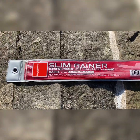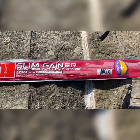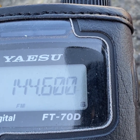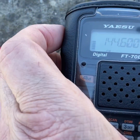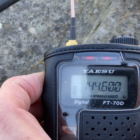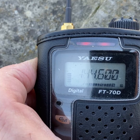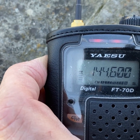This is an antenna I'm going to be using up here for 2s and 70s. Straight out of the packet, years old, never been used — gets its first use today. Transferred over to 144.6 on the 2 metre band and I've put the super gainer up. That should work for 2 and 70s, so I'm going to give it a try on 2 metres now. M0 Golf Echo Tango calling on 144.600, anybody about? Yeah, I've got you, Andy. Signal's a little bit less on 2 metres but you're coming in nice and clear, good audio, 5 and 9.